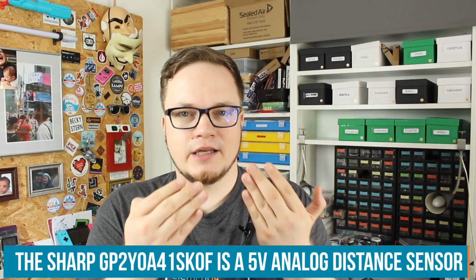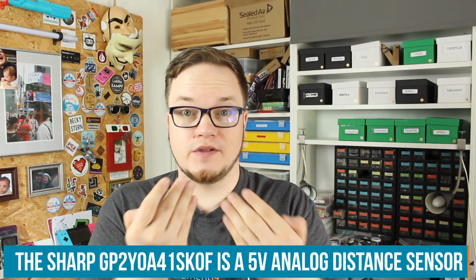So until now, the only thing that was really working was the ultrasonic sensor. I used it in that way, so when you put your hands in front of it, the robot would drive towards you. That was quite okay for the kids at the Maker Faire in Berlin. It was interesting to see some kids were trying to move the robot backwards by holding their hands behind the head, and some were trying to steer it. So I thought, when I use 2 infrared distance sensors, one on each shoulder, maybe I can make it possible that this motion would actually steer the robot. And this is what I came up with.